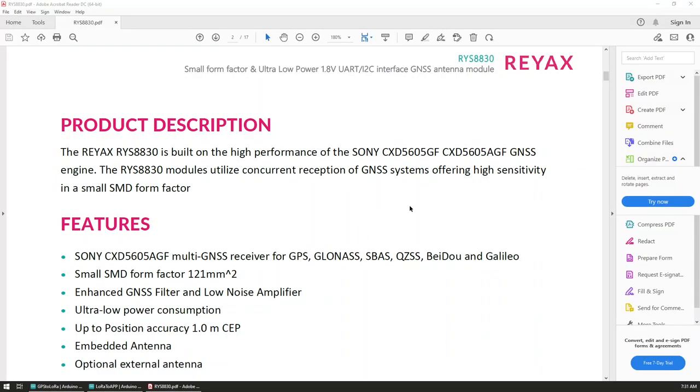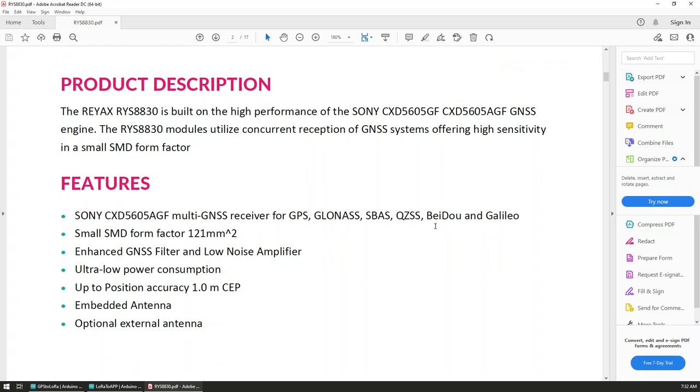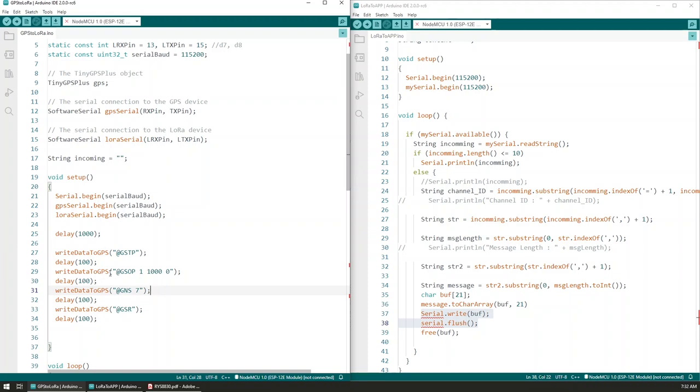From its datasheet we can see that it has receivers for standard GPS, but also for GLONASS, SBAS, QZSS, BeiDou, and Galileo. This means that whenever we use all of them, whatever satellites we have in view will be used for positioning — giving us extremely broad coverage across the entire Earth. No matter where you are or where you need to use this module, you can see all of the features it has. The chip is powered by Sony and it has a position accuracy of one meter with the embedded antenna.